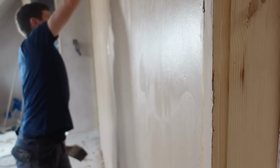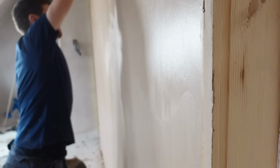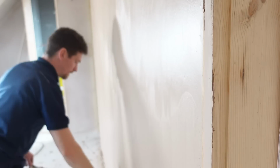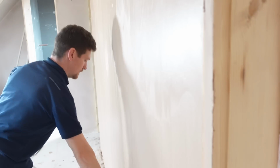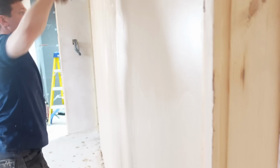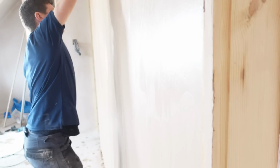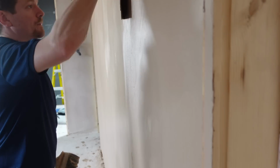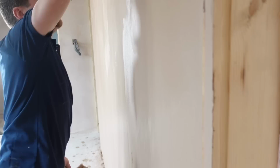Now again, from the top, we are just finishing the wall at the bottom here. Because we've done all the bonding previously, you can see the plaster's finishing nicely to that door liner on the right. So not only is our wall plumb now, it's going to finish nicely to the door liner, so when it comes to the second fix, it's all going to finish nicely. It's not just about the plasterer, it's about the trades after, so we've really got to make sure we keep our job right and do it the best we can. So that's the curve in play.